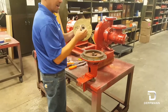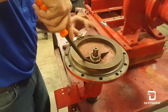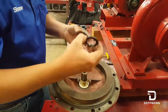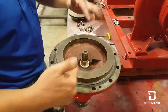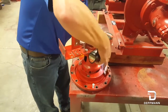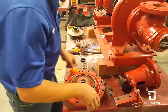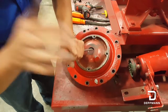I'll pull the impeller off. Here we got our seal spring. And the rest of our seal is down here. This is our rotating element that I'm going to remove — you get a pry bar underneath here. There's a rubber boot here. This is our carbon piece. And our stationary piece is sitting down here — the ceramic and the cover plate. So I'm going to remove the cover plate to get to that. I'm going to flip it over and remove these four bolts. Pull out our bearing assembly. Then from behind this cover plate, you want to tap this seal out of here. You can get behind here with a screwdriver and knock it out.